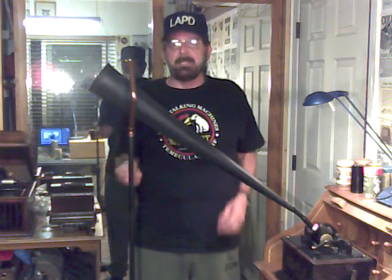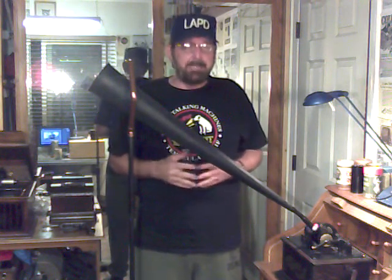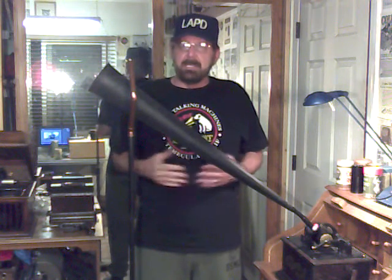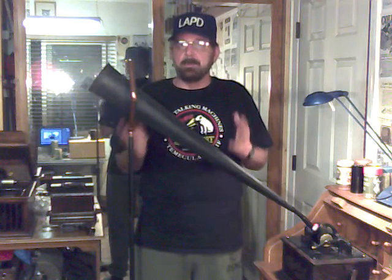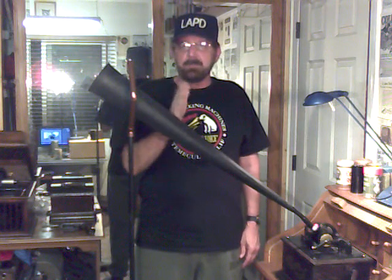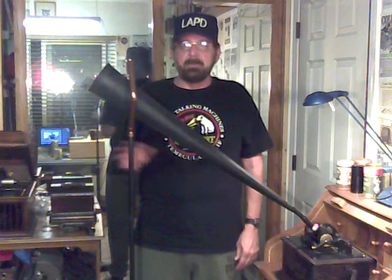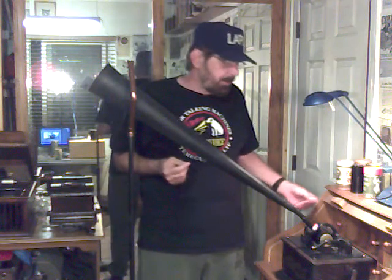Usually it's a matter of adjustment. I got an email tonight from a gentleman named Peter, up in Canada. He's been making some recordings, and it looks like he bought a recorder where the stylus had come off and been re-glued in the wrong place. Unless the stylus is adjusted correctly in the right place on the diaphragm, the results are mediocre at best, and you also get a high-pitched squeal.